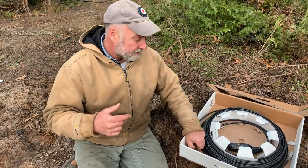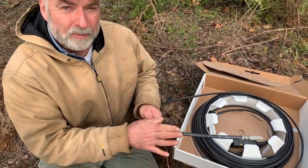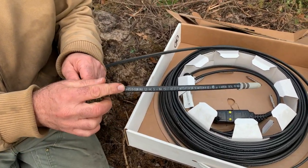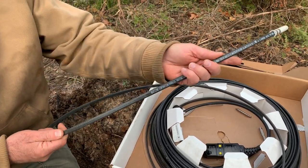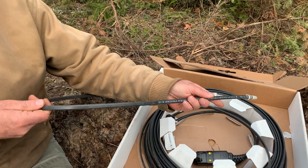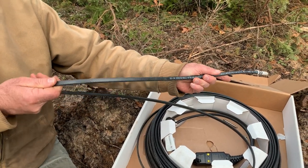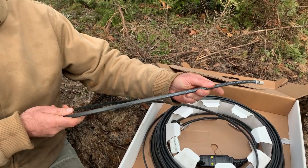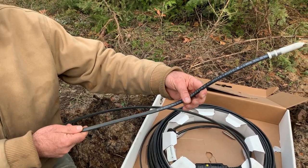This cable is unique in that it has the ability to put out different amounts of heat depending on the temperature at that spot. So theoretically, if one area of the cable is a little bit deeper and doesn't get as cold, the area closer to the surface that gets cold more easily would put out more heat in that zone. It's pretty smart cable.